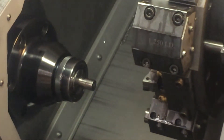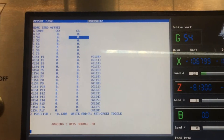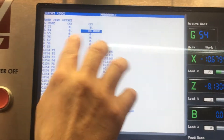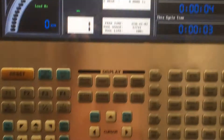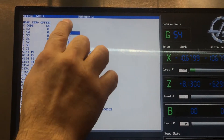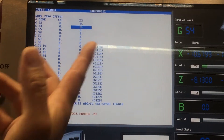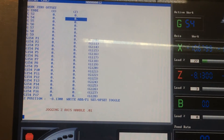Now you have a clean face where all our Z's are going to come off of. At that point, go to your offset page — your work zero offset page. Sometimes there may be a number there. Whatever number is in there, make sure you erase it. Do zero, F1, and that will clear whatever number is there. You want to make sure there's nothing on the Z of the G54. On the lathe, G54 is the default and most of the time — 90% of the time — we're going to use G54.